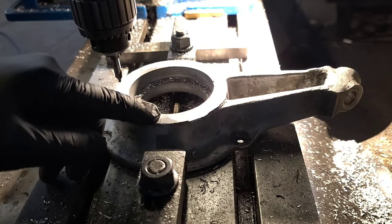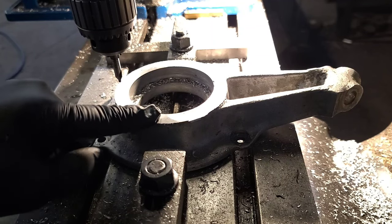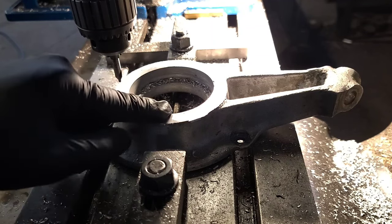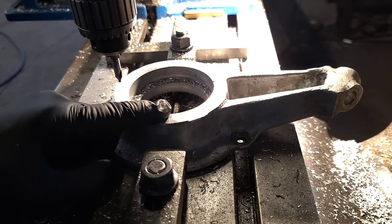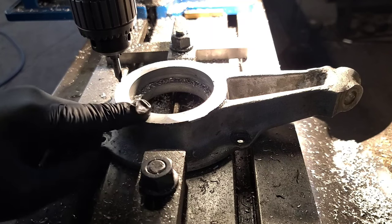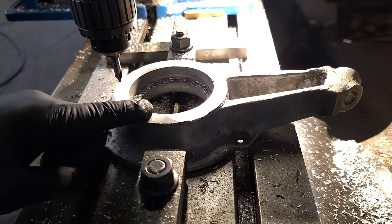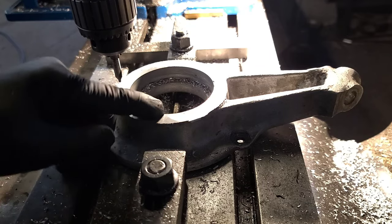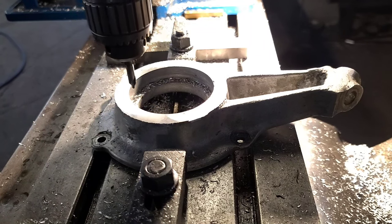Okay, hyperlapse set — off of there. We're at the level now. What I'm going to do is go ahead and do my bolt hole circle. It's just a matter of typing in bolt circle, bolt circle radius, X zero, Y zero, the Z depth, and A start. I'm going to go zero and the number of holes and push go.